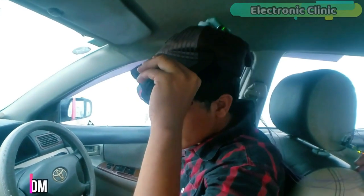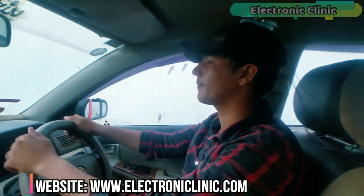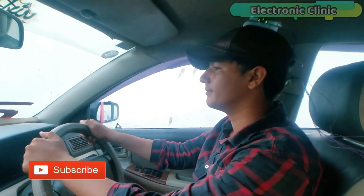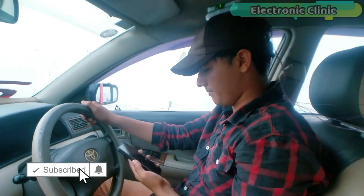In today's episode, you will learn how to reduce distracted driving accidents using only Arduino, MPU6050 and a buzzer. If a driver writes a message and looks down for more than 2 seconds, the buzzer is activated.